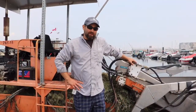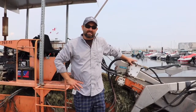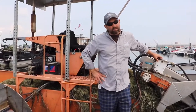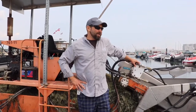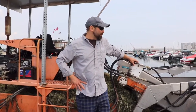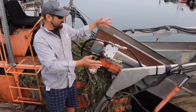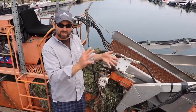What is the aquatic weed harvester? Well, the aquatic weed harvester is in essence a floating combine. It is driven by two paddle wheels, such as what you would see on a riverboat or a ferry boat. The cutting mechanism consists of a large scoop that drops under the water, and it has a sickle blade on the bottom and one on each side.